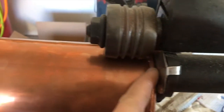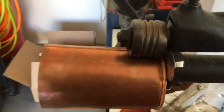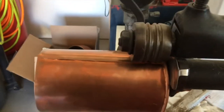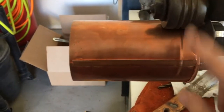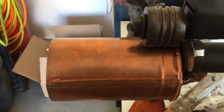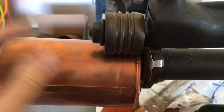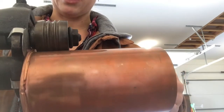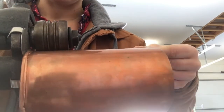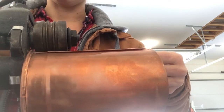You want to keep this completely parallel to the shaft. See how tight it is over the seam — I'm only going to do that once and probably never again because it is going to wreck your machine. Bob doesn't even go over the seam, which is fine. You are going to go through this over and over. You do have to apply a little bit of pressure on this side to keep it against the depth stop. I've gotten to the seam — I don't want to go over it again, so I'm going to crank this.